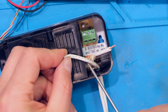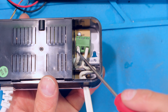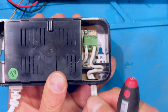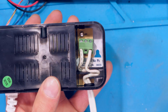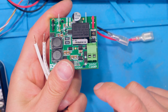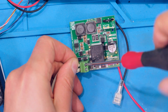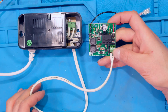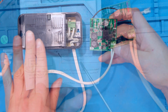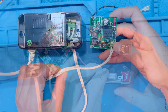I'm choosing the dotted side of my wire as the negative and the other as the positive. I've wired the negative and the positive, threading the wire so that it's held in place and won't pull out of the terminal. I now insert these two wires into the terminal over here. This terminal has no polarity, so it doesn't matter which way you insert them. Using a flat screwdriver I tighten the screws. According to IDS, the wire should not exceed 30 meters.